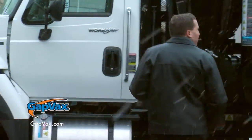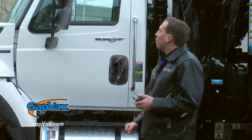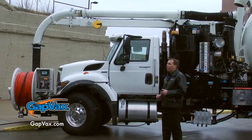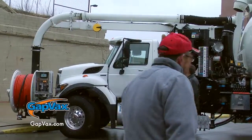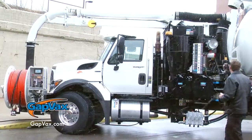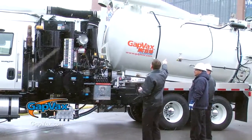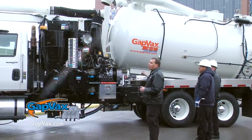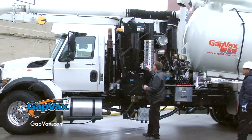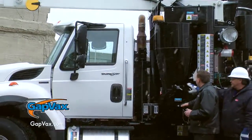The truck is equipped with a front-mounted boom. The boom will rotate 180 degrees and reach 26 feet from the centerline of the truck. The way the vacuum system works, you vacuum in through the end of the boom. The material travels back across the top of the truck through the 8-inch pipe, drops into the tank, and the air exits through the 10-inch pipe. The 10-inch pipe slows the air down, spins the material through the cyclone, and clean air is pulled back up through the center of the cyclone while the material drops out into the hopper.